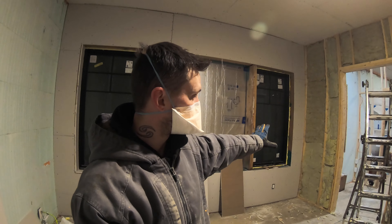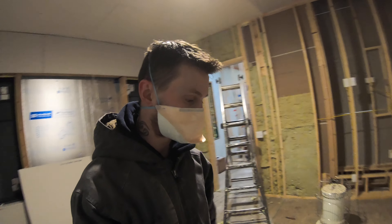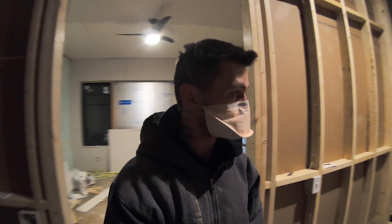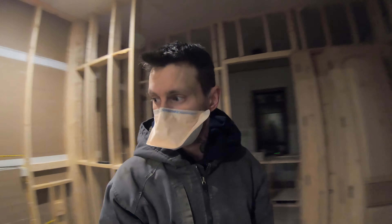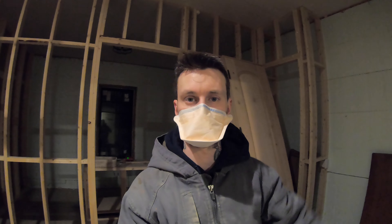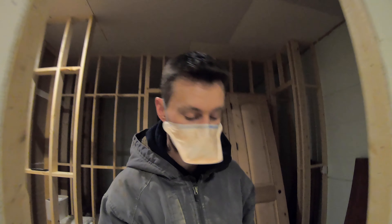It rips down very easily. So far we've only got one bag used up, so we're only going to use one more bag over here probably — maybe only three total. We're definitely going to have some leftover by the time we insulate the whole back wall over here. And then maybe we'll insulate this wall in here so if somebody is taking a shower, you don't disturb somebody sleeping because you're cutting down on that sound transmission through the bathroom wall.